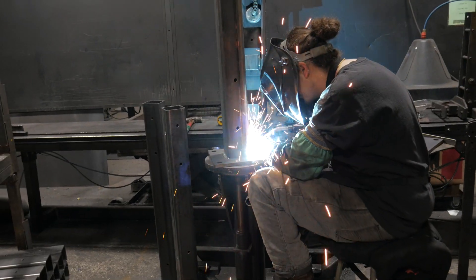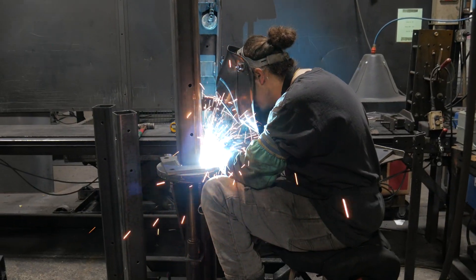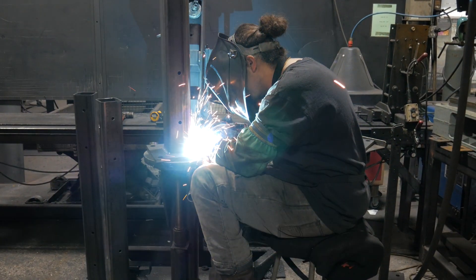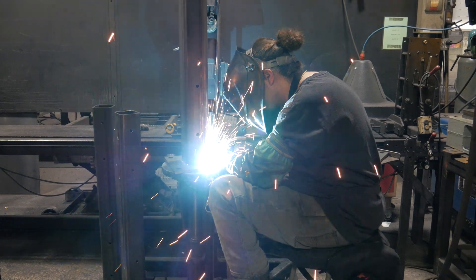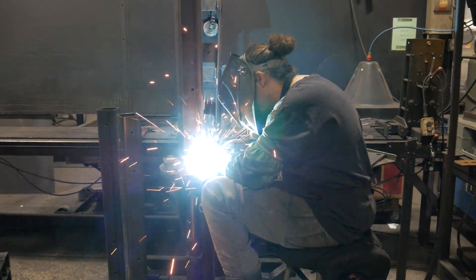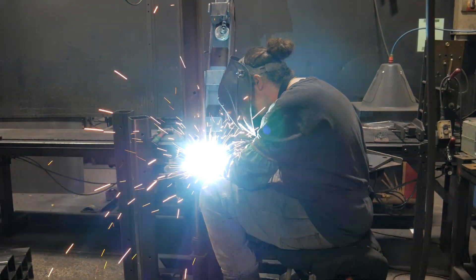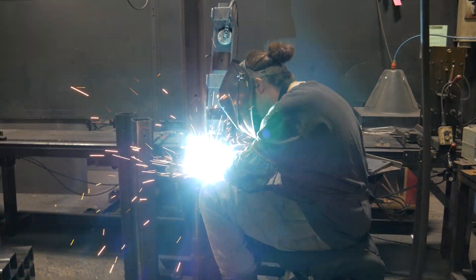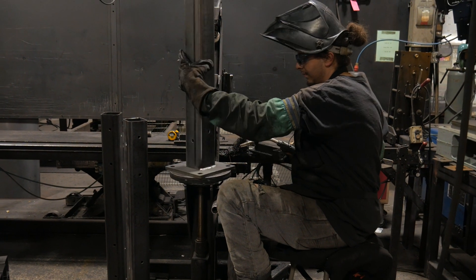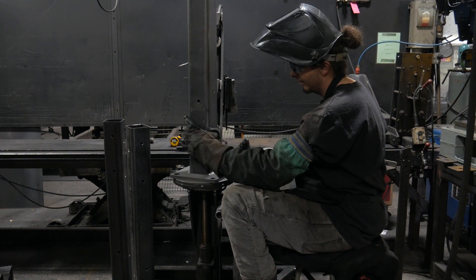What you'll notice on Joe's table here is it's designed to get the welder in position — you've got the fixture behind that keeps the base plate at a 90-degree angle to the tubing itself, so we keep everything square. This is one of our longer, more time-consuming welds. So rather than have the welder walk around the table, we made a table that actually adjusts so he can spin it as he does his welds and sit in one ergonomical position the entire time.